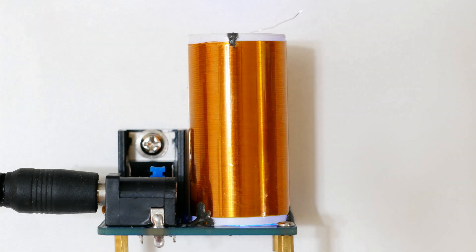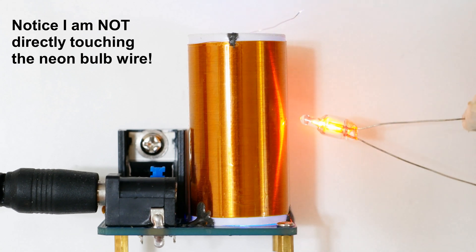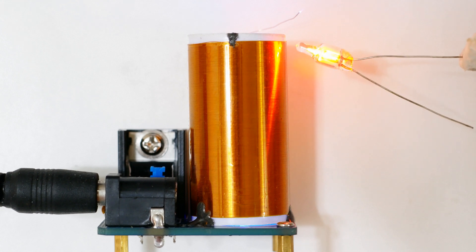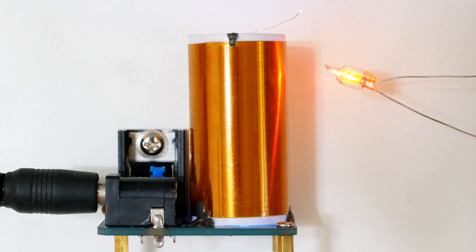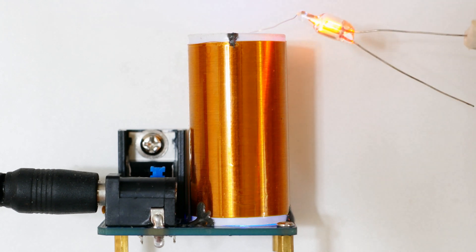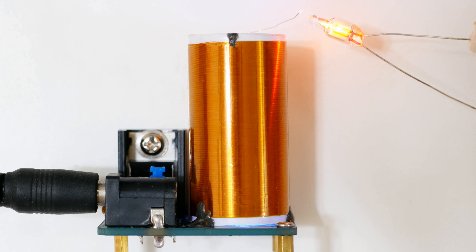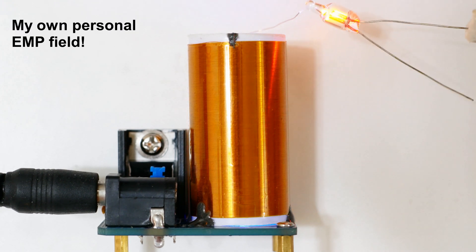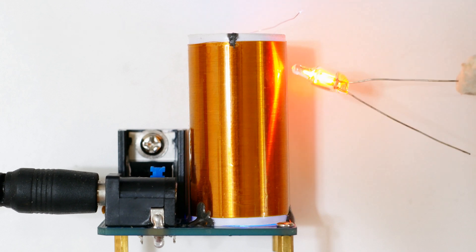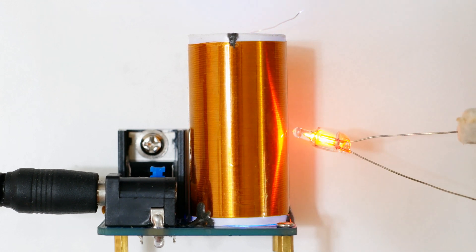They included a neon bulb with this. Down near the base it doesn't do much, but as I move up, the bulb gets brighter because the electric field is getting stronger. The neon bulb lights up somewhere between 35 and 70 volts. I estimate that at the tip where the plasma is, the voltage is somewhere between 750 and 900 volts depending on input — which would trash anything electronic, including this camera, which I'm keeping far away and insulated. You can see the brightness increasing and decreasing as you move up the coil.